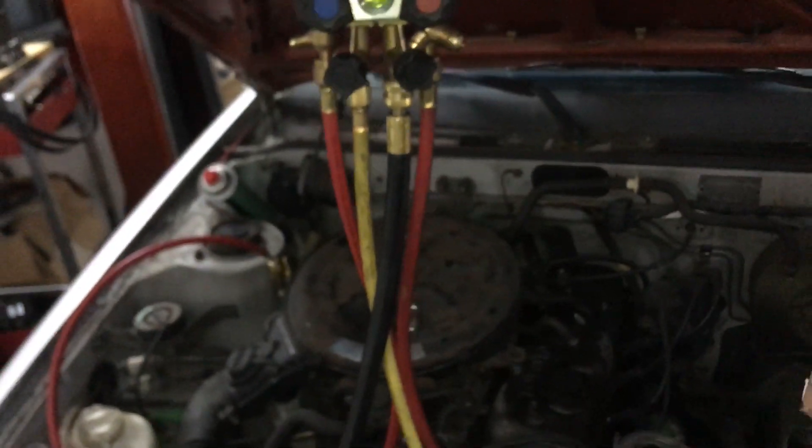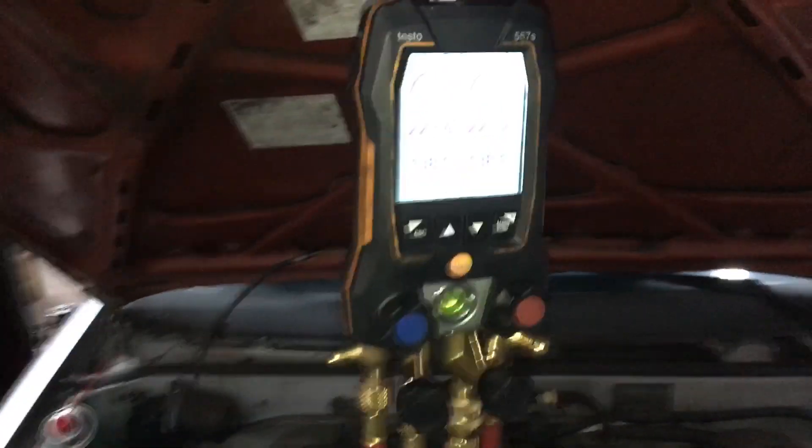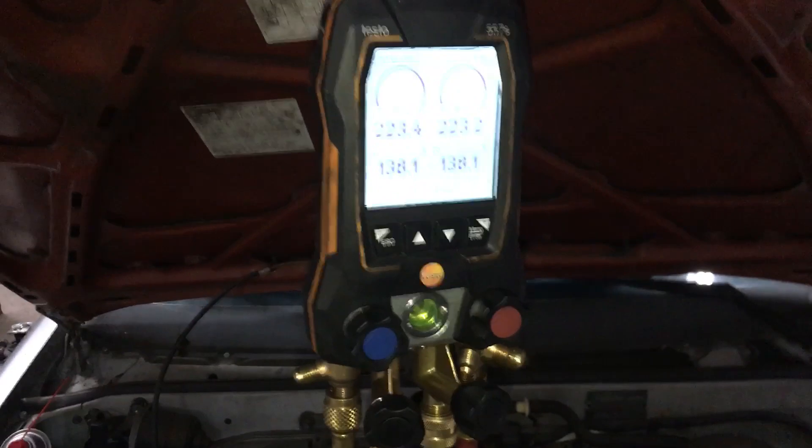So I'm going to put this under a vacuum again. I'm actually going to do a triple purge — evacuate, nitrogen, evacuate, nitrogen, evacuate — three times. Then the pump stays on it overnight evacuating. I'm going to put some of my dye in the system even though these already have a dye in them. I'll just leave my scrappy eBay cheap garbage gauges on here.